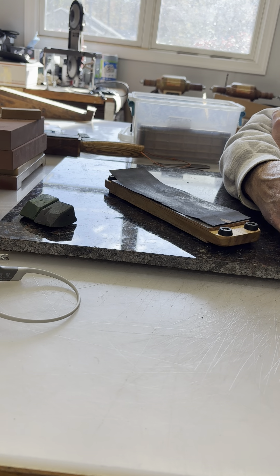The good news is when you are a little shallow, you're not hurting anything with this knife — you're not rounding your edge, you're just sort of polishing back here. You'll have to take those scratches out if you want, but you're not hurting the edge. So start too shallow, and then you're going to want to rock that ever so slightly as you go until you feel the edge grab. That can't be taught — you're going to have to feel that. It also sounds different. Hear it? It kind of makes a different sound. This sound is different from this sound. I think you will hear it when you practice.